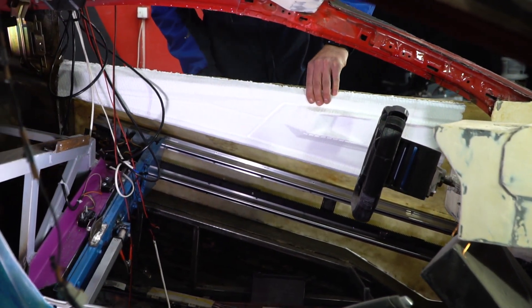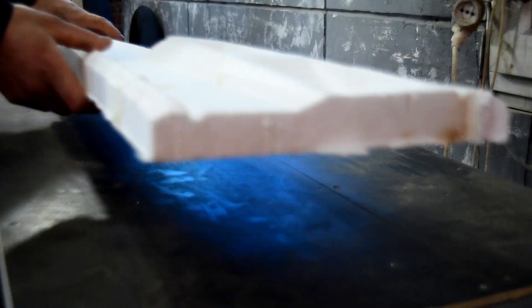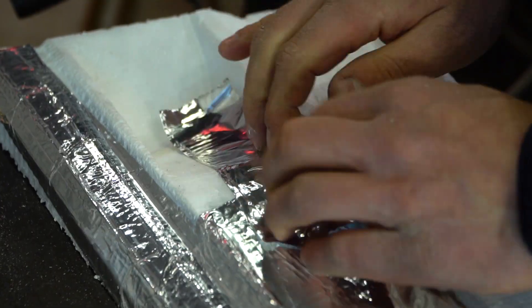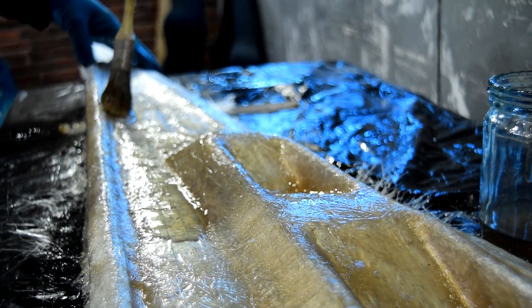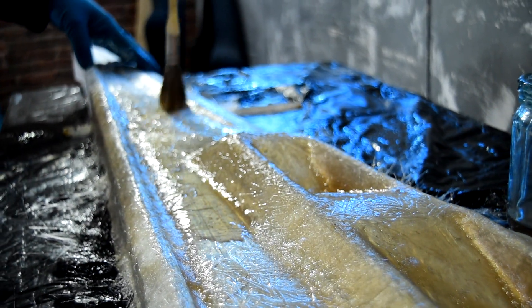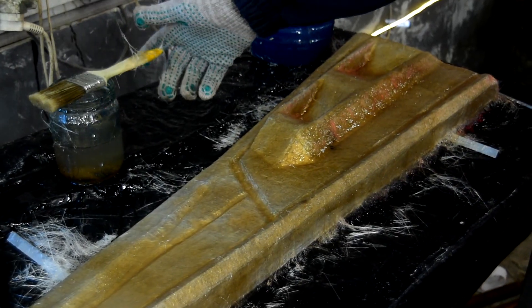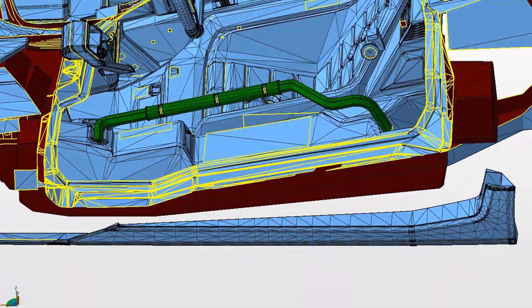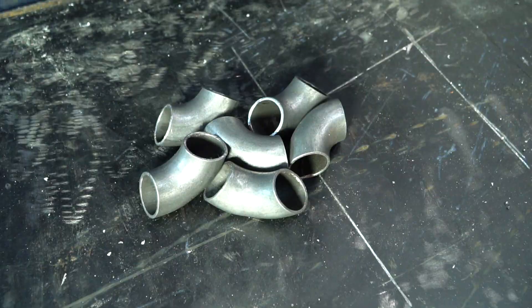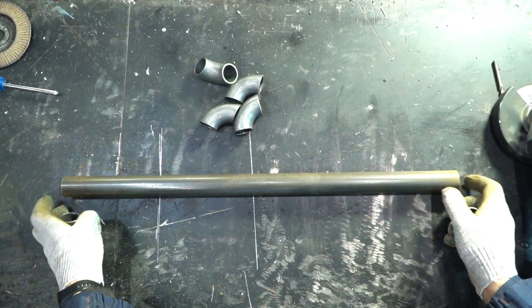I decided to make an incomplete door sheet and cut only the most complex element. I don't know yet whether to make a matrix for it or glue it with fiberglass and paste. I covered it with aluminum tape and applied glass fiber mat with epoxy resin to this detail — too many elements, most likely I'll make a matrix out of it. While it dries I'm going to deal with another door mechanism element, namely the safety protector. It's needed so the sleeve cannot accidentally bite the movable mechanism of the door. There are too many bends on the protection pipe in different directions, so I decided to make it out of different pipe elements.